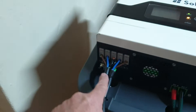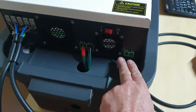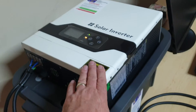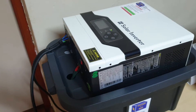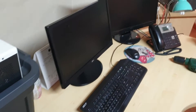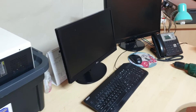In other words, it draws power from the grid. You can see we're plugged into the grid there, it's plugged into the batteries here, and you can plug solar in here. We haven't got solar plugged in for this demonstration, but you would plug your solar panels in here. This inverter supplies a maximum of three kilowatts at any one time — to give you an idea, three kilowatts would run a kettle. A small office as we've demonstrated here uses very little, only about 100 or 200 watts.